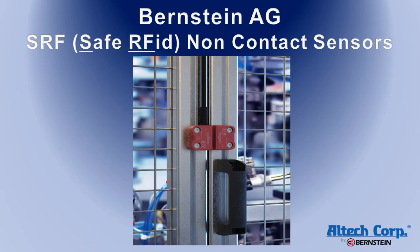The new SRF safety sensor overcomes many of these shortcomings and offers several additional features, such as M12 plug-in installation. You can run up to 32 switches in series. Category 4, PLe, SIL class 3 safety ratings. A protection class of IP69. Low, high, or unique coding. Fault-tolerant outputs. With other options including local reset, daisy chain or PNP diagnostics, IO-link communication, and Android smartphone monitoring with near-field communication.